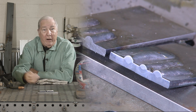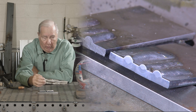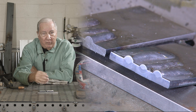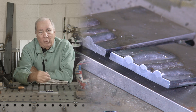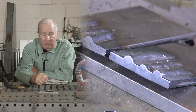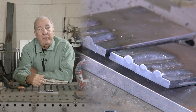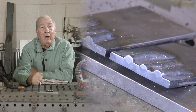So that's what happens with wire feed speed — it controls penetration, heat input, and the amount of wire you're putting down. You can go overboard by turning the wire feed speed up so much that you're just piling weld metal on top where it doesn't affect the strength. In fact, it ends up being counterproductive because you're just wasting money. Basically, you try to find a happy medium where you get the penetration you need with the proper bead profile. Hopefully you picked up on that. Thanks for watching MIG Monday and we'll catch you next time. Take care.